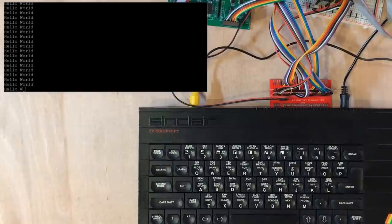Okay, well, I think we've proved we've detected that memory write correctly. That's kind of fun. That was more rewarding than I expected it to be, but I really enjoyed it. And I do feel we've dug in, got a decent understanding of the signals coming out the back of the expansion port. I'm pretty sure I didn't need that extra line driver as a buffer there, although maybe it made a difference. The actual reason why all the text was messed up when I first got it going was I'd got the data lines in slightly the wrong order, which obviously corrupted the characters that I was getting sent over the serial line. Maybe a bit more testing back when I just had the LEDs would have uncovered that. But it worked, and we've proved we can actually interface stuff into that connection.